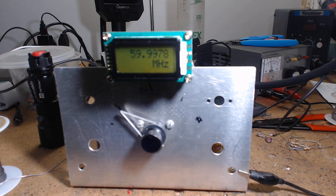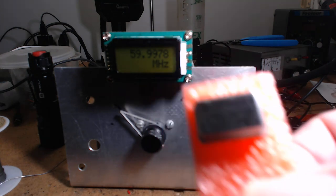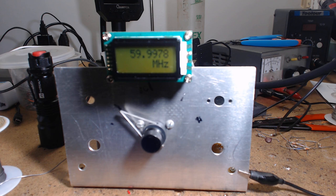We did learn something sitting here waiting. I have a 50 MHz module coming today — it's out for delivery, took two days from California. That's what I was waiting for, hoping to get rid of the bobble. Now I know some of the bobble is from either the oscillator module or the frequency counter module. I'm getting closer and closer to 10 Hz resolution on an oscillator — I think that's it.